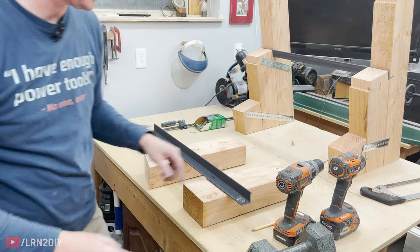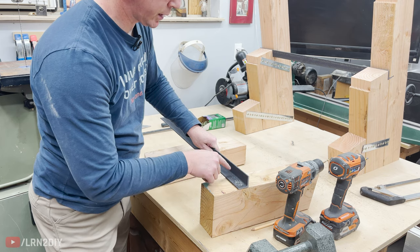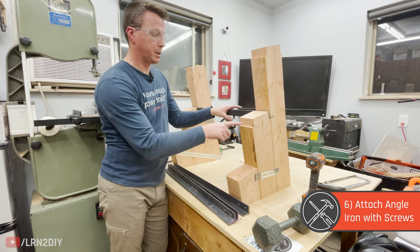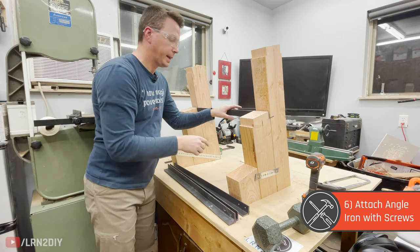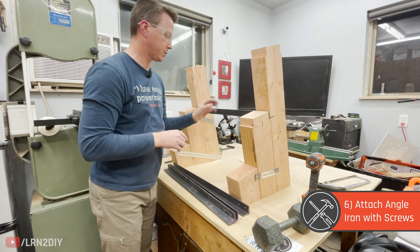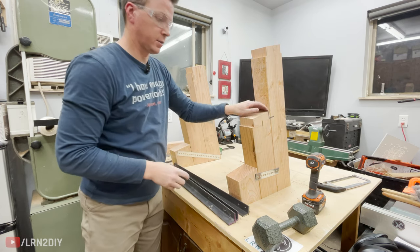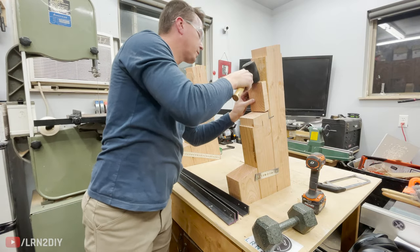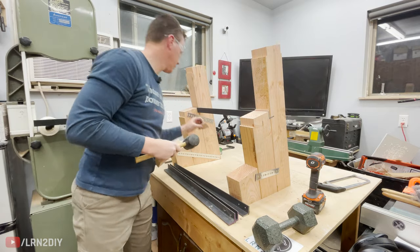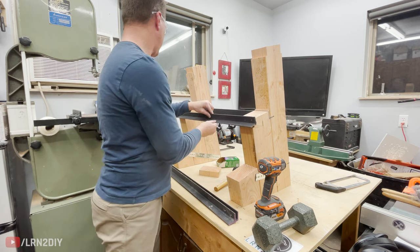So we'll do that times 12 — two on either end. We want to do one about three quarters of an inch in, and then another one about three quarters of an inch from the other side. We're nearly done here. Now we get to put our angle iron onto the racks, because they have these nice little shelves — gravity is working with us, which is awesome. One option is you can drill out these guys and put them in first. Honestly, I messed up and forgot to do that, so I came up with a creative solution to fix that. I took the pieces of wood that we cut out of these and matched up the grain, then sanded them down into little wedges so we can wedge those into place — really all we're going for is just to keep this snug so it's not going to go anywhere. I'll do the same thing on this side, and next we'll take our drill and screws and attach all the bars.